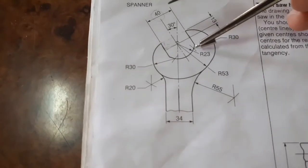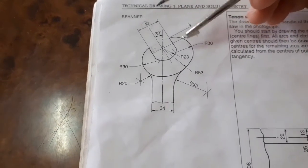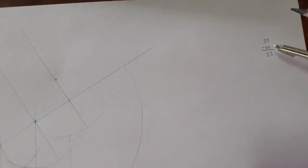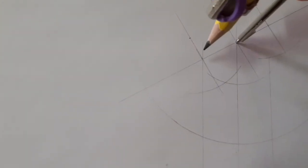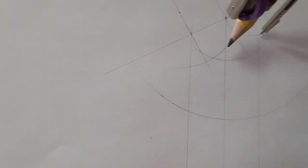This right here is the center — for the arc that comes here. I need to explain why: this arc we are drawing is supposed to be inside this big arc. Because it is inside, remember it is subtraction. The radius of the big arc outside is 53; 53 minus the 30 — the radius of our arc — gives me 23. And if you remember, you already had 23 — from the center I draw 23, which I already have. So 53 minus 30 gives me 23.